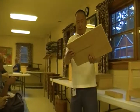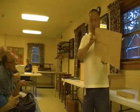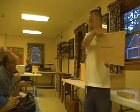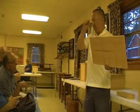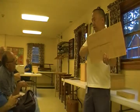Oh, that's easy. Basically what I did was, I took one board, popped it up like this, planed it across so it was square and flat across the top. And then I took a really thin shaving just from the middle part so that there's a very, very slight concavity in it, really super thin. And then I did the same thing on the other side.